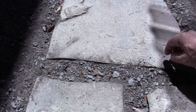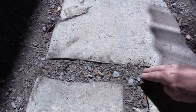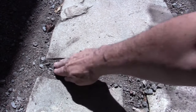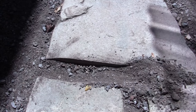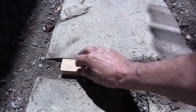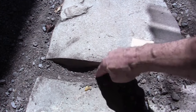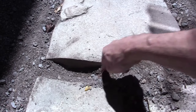The manufacturer says that the spaces must be at least a quarter of an inch, so there's no problem here in the pathway. But he says you should dig down by at least one inch all the way through. For example, you could use a block that's an inch high and put it there to gauge the depth. He also suggested you could dig down to the height of the flagstone, but that could be quite deep.